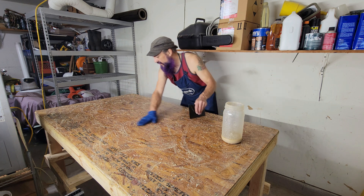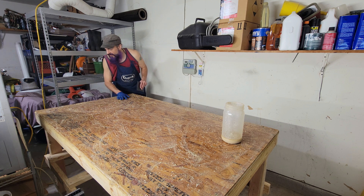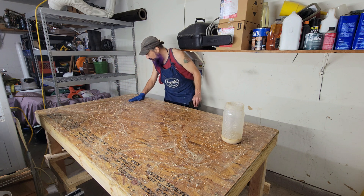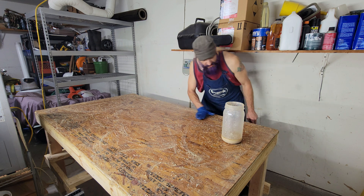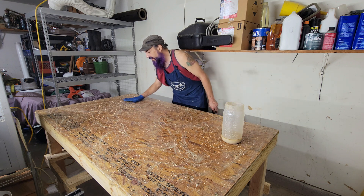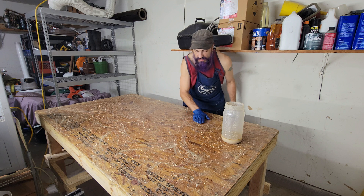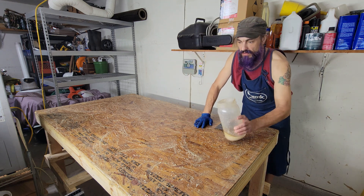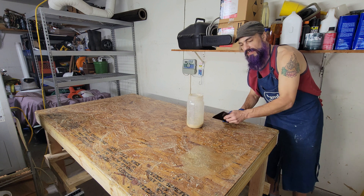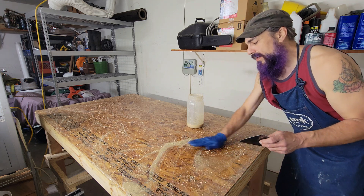It is my intent to use the full mass of what I've got left. If I really wanted to set this for the petrification process — which is essentially what we're doing here — I can apply heat to it. There are a lot of really awesome research papers out there about making petrified wood using sodium silicate. Basically you are soaking wood that has been really well dried in a vacuum, then under pressure adding the liquid and heat to actually set the silica into a rock. There are experiments where they've made stuff that is very close to petrified wood in the manufactured process — extremely durable and fire resistant.